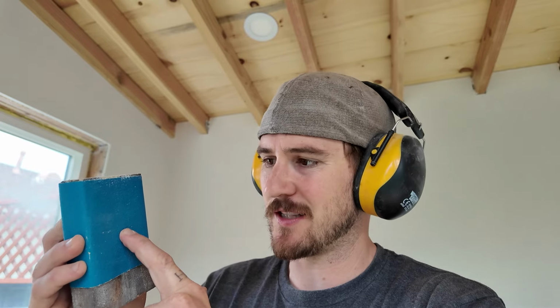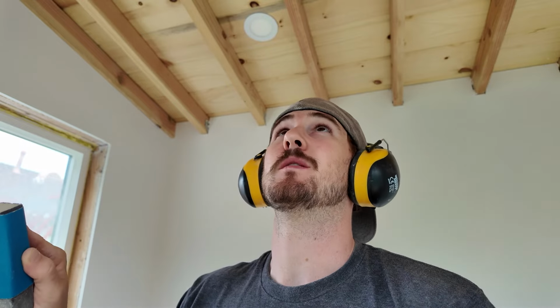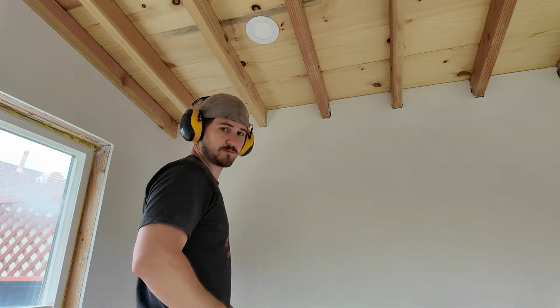Those strips peeled away pretty well. I'm gonna get up there. I've got a sanding block and I've also got some 120 grit paper, and I'm just gonna clean up the rough edges on basically all of them, so that I have the flattest edge to create the caulked joint between. And then I think after I do that, I'll probably go back and do one more round of touch-up with paint up there. This is where it's just a bunch of boring finishing details, so I'm probably not gonna show a lot of it. I'll just show you the after.